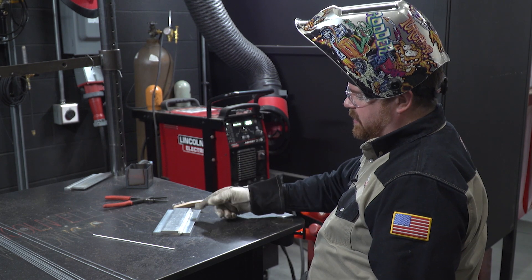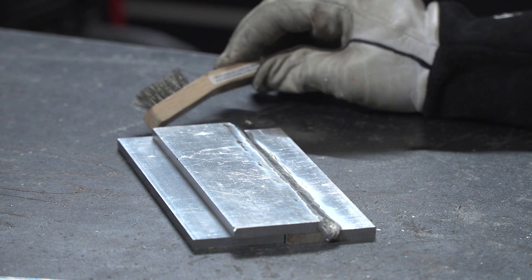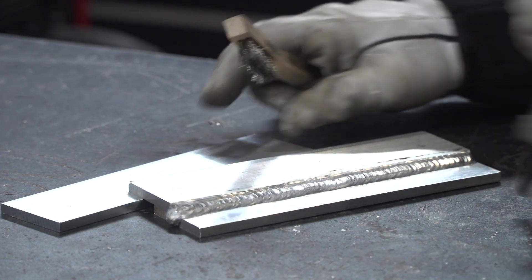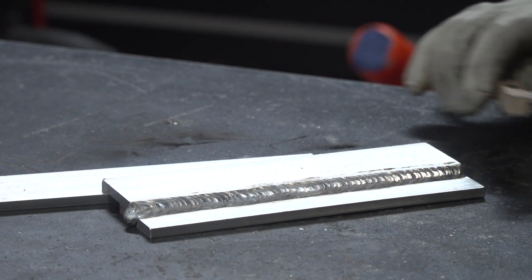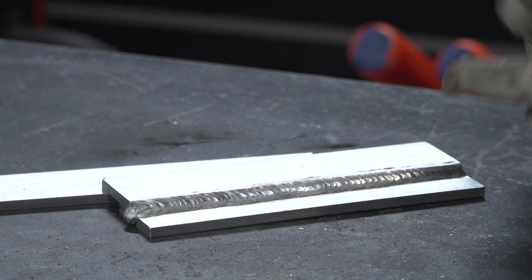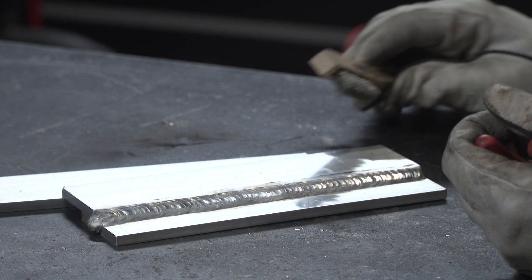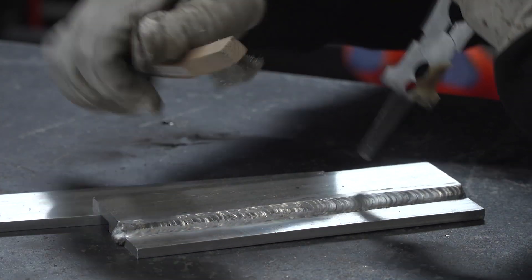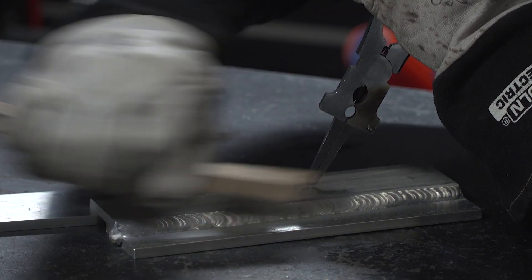If you look at the surface, notice down the middle it's silver — that's where the oxides are completely burnt off. Along the edges we still have some oxides; those can be mechanically cleaned. That's where my torch was and where the initial arc was. It's direct current so the arc isn't spreading all over — the arc is focused right down the middle, coming from the tip of the tungsten all the way into the base metal. I'm going to mechanically clean it once more to get those oxides off and make it presentable.